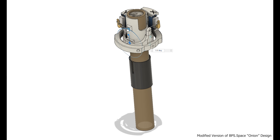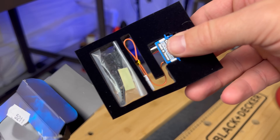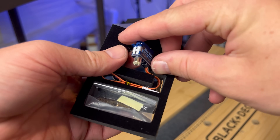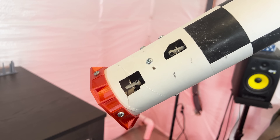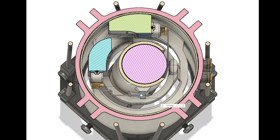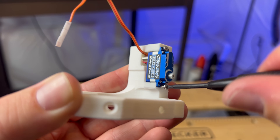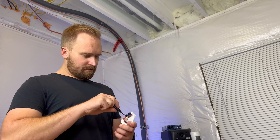Eagle's gimbal is able to articulate plus or minus five degrees in both axes. By using smaller servos and moving them closer to the center of the gimbal I was able to avoid the window cutouts that had caused structural instability for the previous rocket models. The gimbal's components are 3D printed using PLA and then later screwed together.